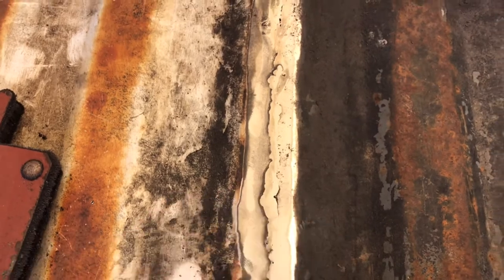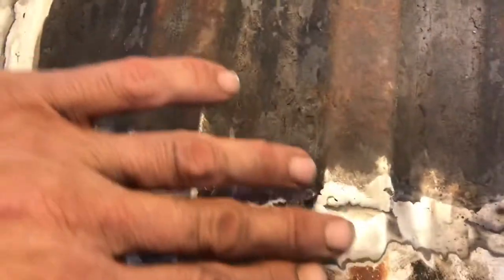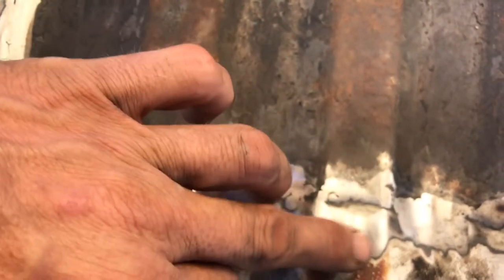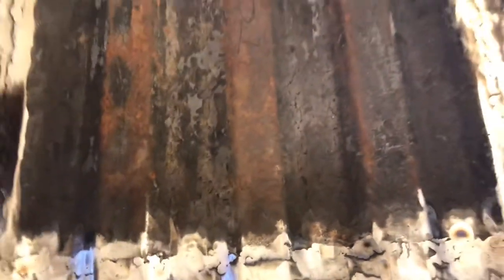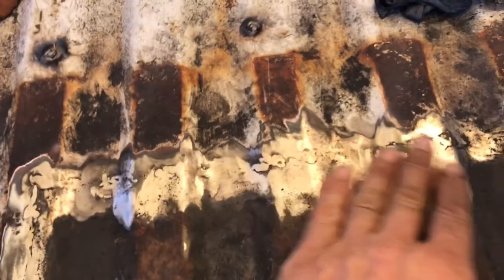I think that's about as far as I'm going to do it, because I'm going to be spraying this Rhino Liner and this is not a show truck — this is going to the dump. I left the weld a little bit proud, a little bit higher. Stuff's dented up so things were not perfect, but they were real close as far as the lineup. If you don't have it perfect and you try to sand that weld out flush, one piece is going to get sanded too thin.